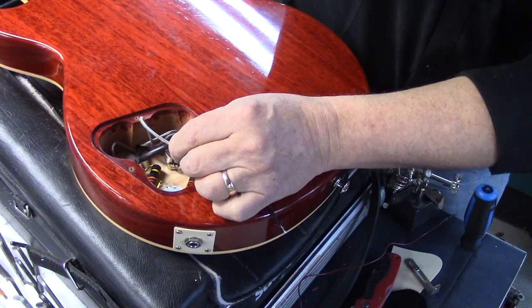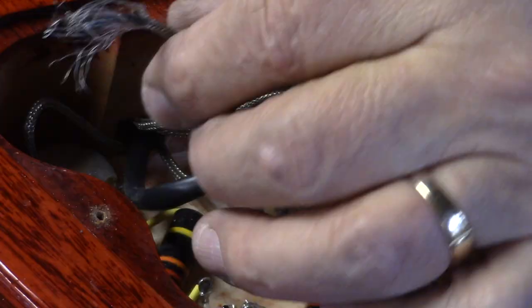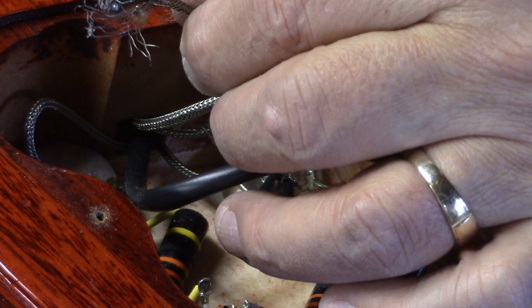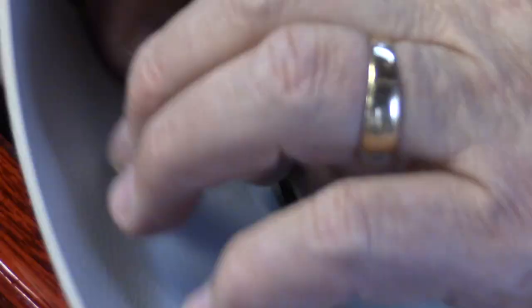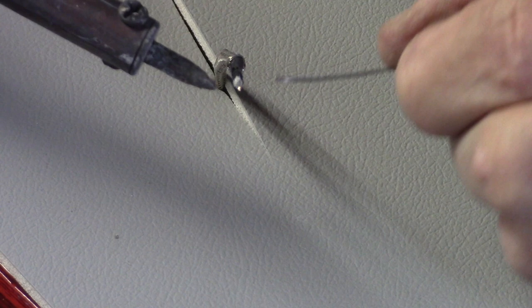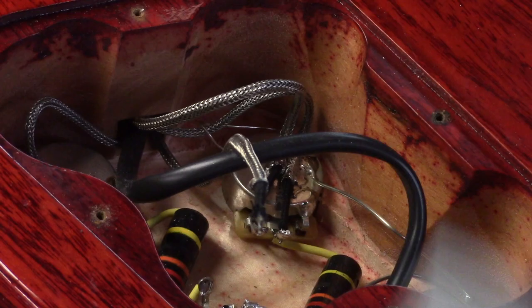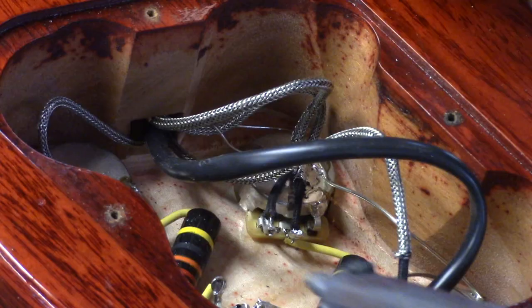So we'll clip this wire back because we really don't need all of that length to reach our destination. Okay, I've unraveled that shield with a dental pick, and we'll just cut that back. Put that splash shield back into place while we tin that lead. Kind of fold that up. Make sure you don't touch anything with that iron. Lots of stuff to melt and burn there. That lug needs a little bit extra solder on there.